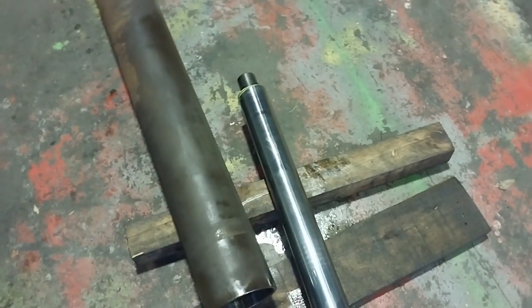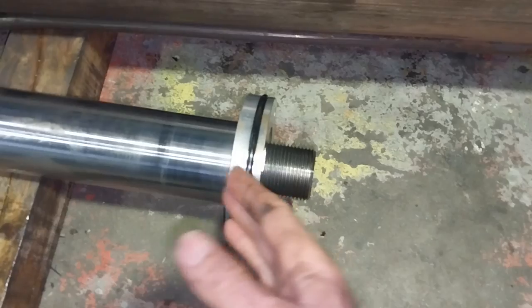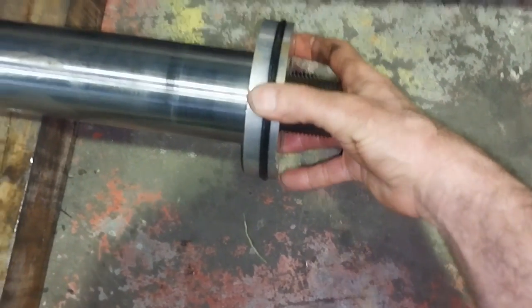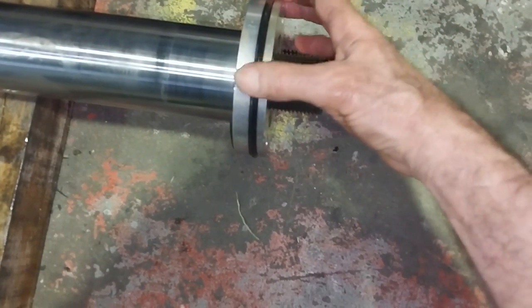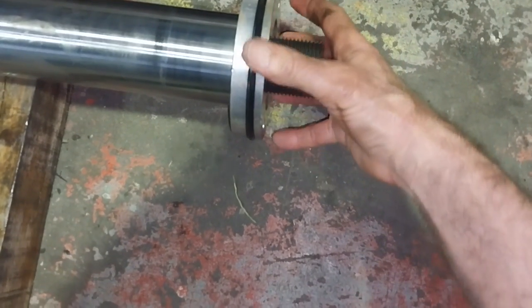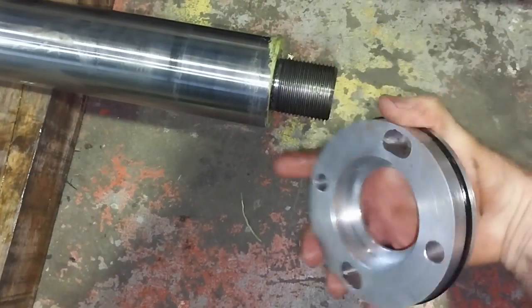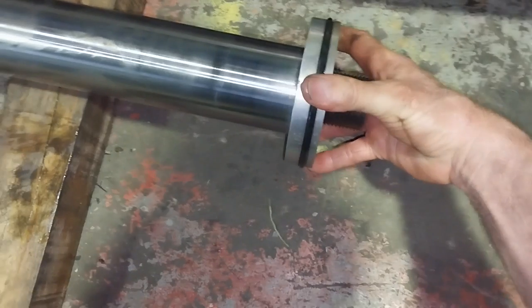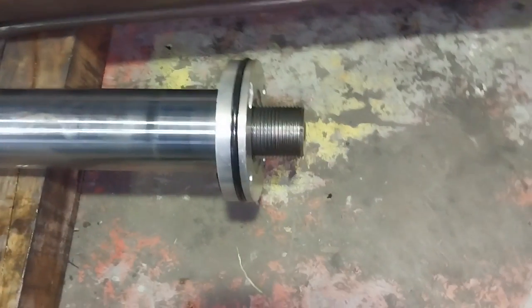One of the guys suggested making a collar, so that's what we did. We found a piece of aluminium that was a little bit sloppy in the barrel, so we machined it with a step so that when it goes onto the piston as we push it down, it doesn't slide down the rod — the shoulder holds it there. Because it was sloppy, we machined an O-ring groove to centralise the rod in the collar. We also wrapped some masking tape around it to make a much firmer fit, so if we were unsuccessful we wouldn't leave another piston inside the barrel.